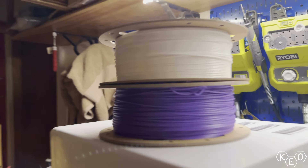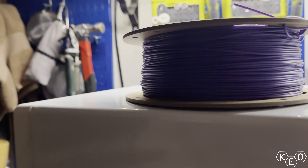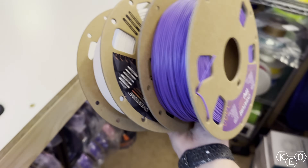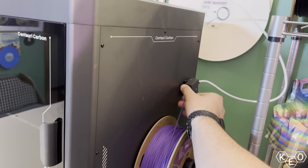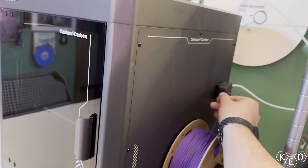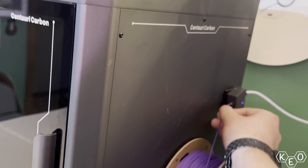Now back to this filament that I left in my garage. Previously, I tried a similar test with waterlogged filament because my garage is very humid — we're in the Midwest, it's summer, and it's humid. When I tried this previously, the stuff was so waterlogged that it clogged up my printer and the print wouldn't complete successfully. This spool's been out there a few weeks, so it's probably going to be worse. I'm going to load this up, try printing with it, then dry it and do the same thing again.